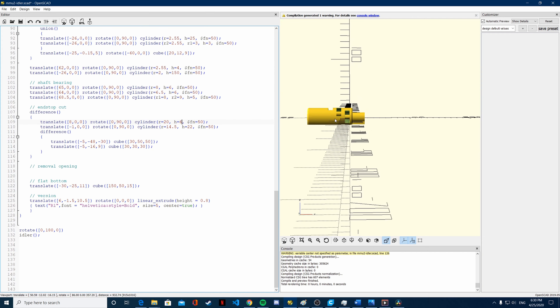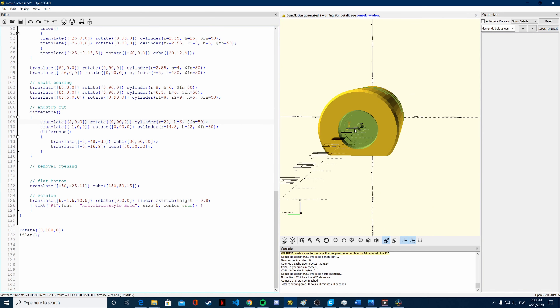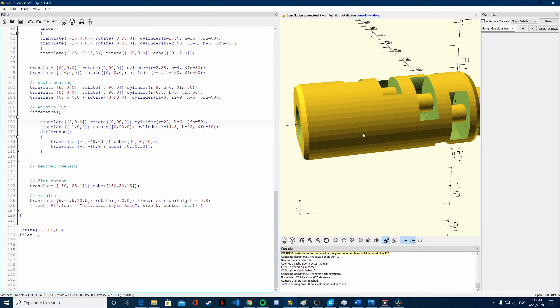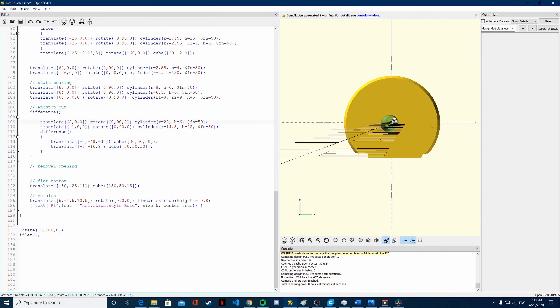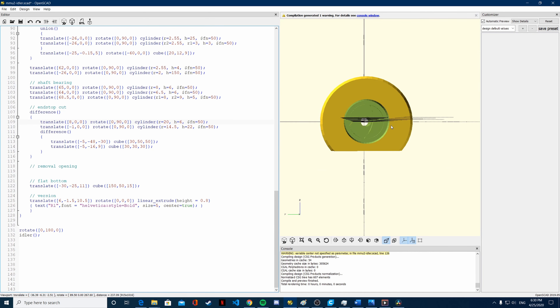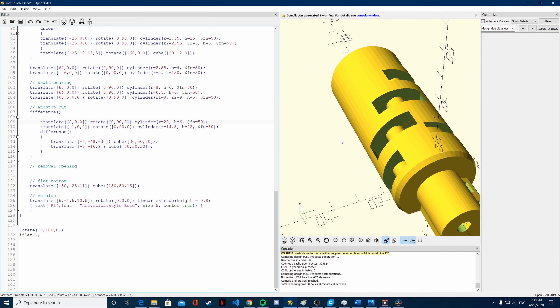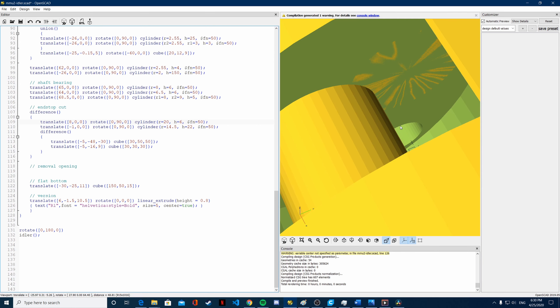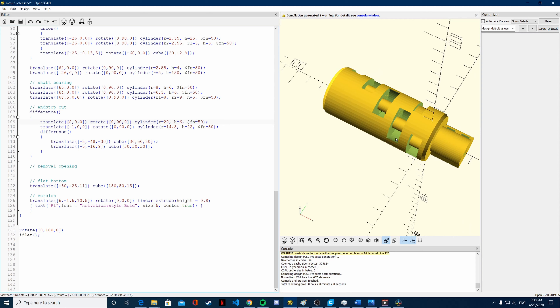We can notice another thing that we want to edit. We want to have a plastic axis coming out of this, and no longer the metal pin with the bearing — that should make the design simpler. You can also see that there is this big hole going through all the way. We actually don't need that because we are not inserting any pin or any kind of thing in my design, and I don't like the fact that it is coming through the bearing here. We will remove that right now.